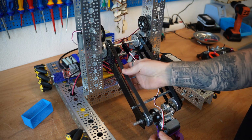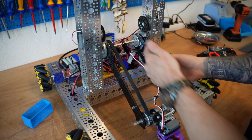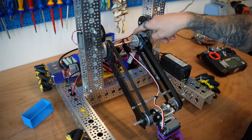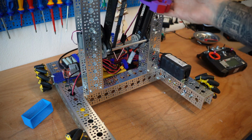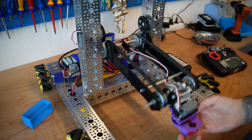And the answer lies in replacing one of those physical links, one of those arms, with a virtual one. In this case, I've created a virtual arm here with a pulley and a belt and some pulleys, but you could also do this with some sprockets and some chain. Both would be acceptable. As I lift this up, you'll notice that the arm stays parallel. That end effector, our gripper, stays parallel with where our system is.